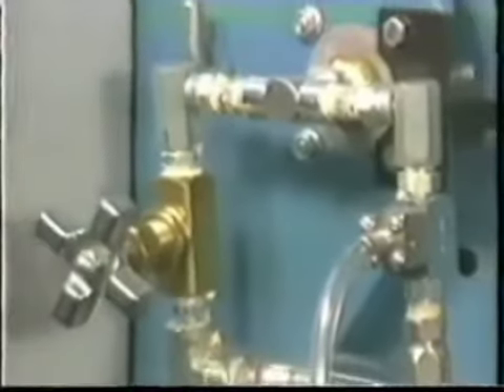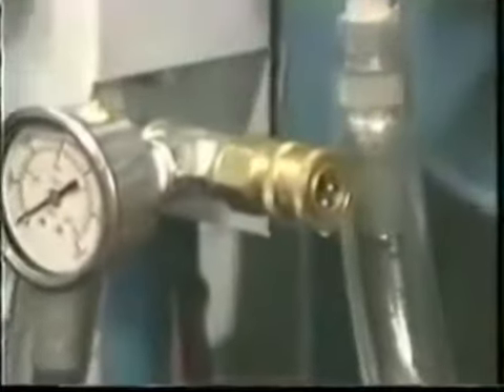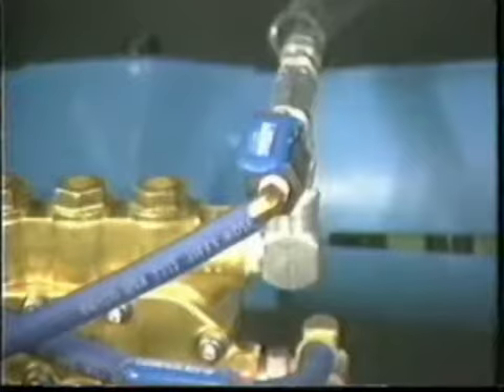The fluid-filled pressure gauge and the high-pressure snap coupling — make sure the outlet on the hose reel is attached to this fitting. The water outlet valve makes priming the pump easy. Have this valve in the open position before starting the pump, and close after prime to achieve correct pressures for jetting.